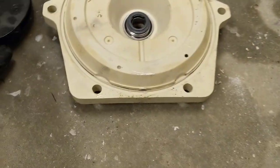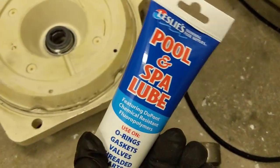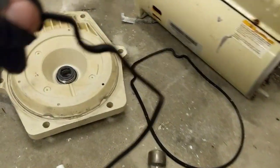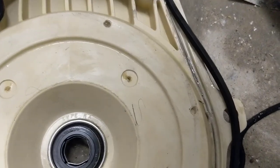I got the seal plate all prepped and ready for the new seal. Using some Leslie's pool and spa lube — I just put a bead all the way around here where the gasket is going to sit in. So now we'll go ahead and get this ready.